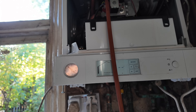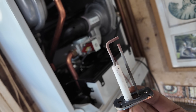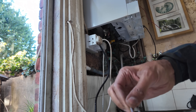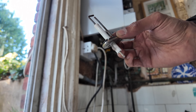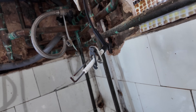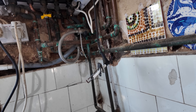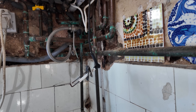Reset it, let's have a look at the electrodes — they seem absolutely fine, nothing wrong with those. Gaskets are fine too. Nothing going loose. What I'm going to do now is check if I've got a spark coming off these. I've turned the gas off and I want to see if I get a spark going across those electrodes. No — it doesn't seem to be sparking. So it's either a fault with the lead or a fault with the board.